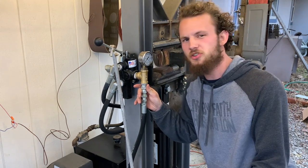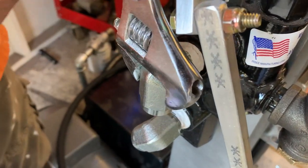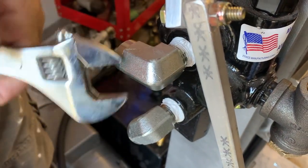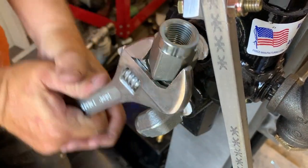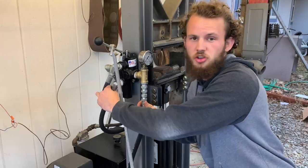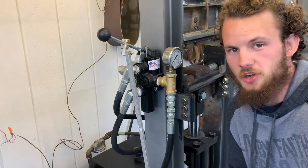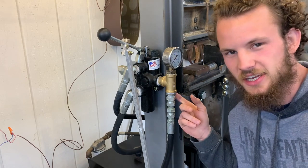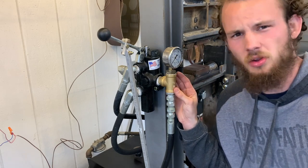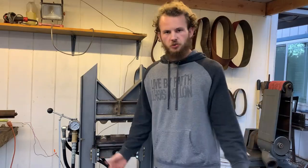For the high-pressure lines, you should use high-pressure hydraulic fittings, and I recommend using swivels at every connection on this press. On some connections we only use swivels on one side, but the problem is that to unhook it you need to undo both sides in certain circumstances. Using a high-pressure swivel hydraulic fitting lets you orient it in any direction and tighten it down as desired. One note: the T that we used for our gauge is not a high-pressure hydraulic fitting, so we do get a little bit of leakage. They do make tees with swivels for this application — we'll link that in the description.